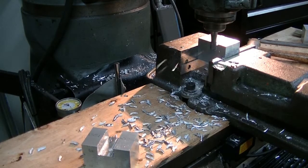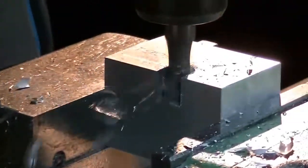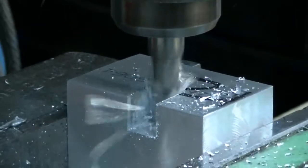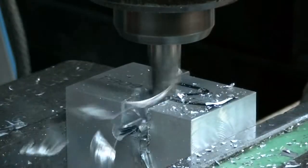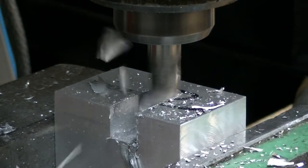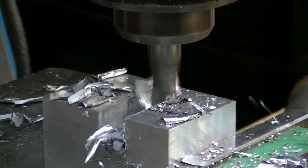I'm going around 700 RPM for the cutter speed, and I'll do a little WD-40. There's my first cut. The first pass is the heaviest as it initiates the first full depth of cut and the full width of the 0.625 cutter.